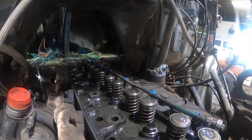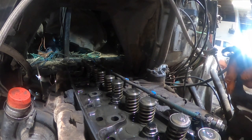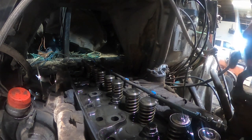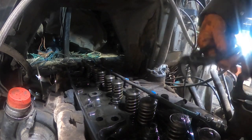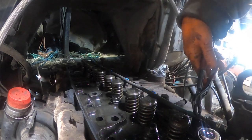There's another thing that causes something similar - it'll fool you, it's called liner cavitation. That'll sometimes look like electrolysis. But that particular case was not liner cavitation, it was electrolysis - and he was going to tell me all about it though, by God.